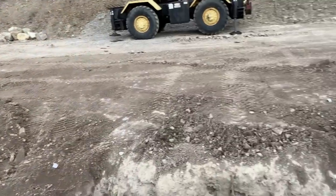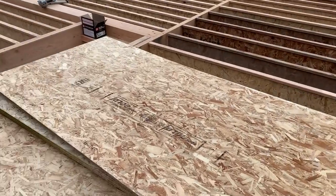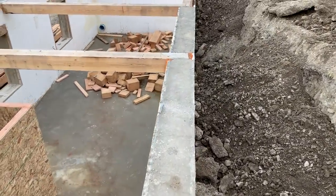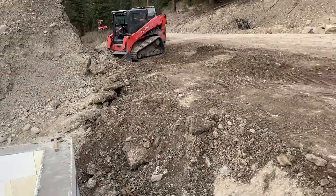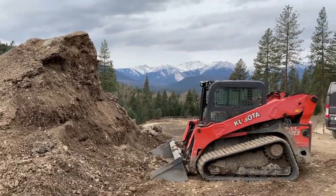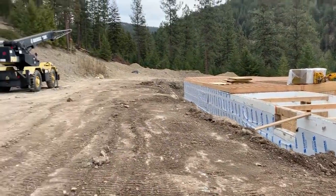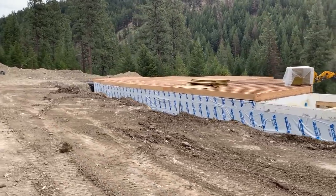I'll still get the backfill done this afternoon — it's partly filled, but you don't want to backfill until the subfloor is on. Once we get the plywood — the OSB — nailed in place, then I can backfill the dirt against the walls. This area will have a concrete cap because it'll be my wood storage. The skid steer track loader is excellent for moving dirt — it's partially frozen, this being the day before Thanksgiving. I had to break through the frost this morning. There's the crane that will set the logs in a couple days.